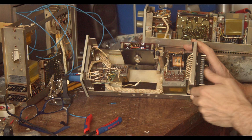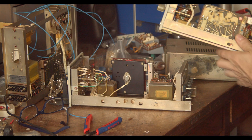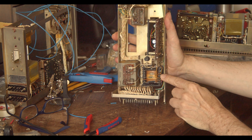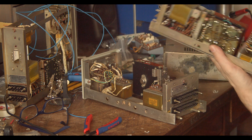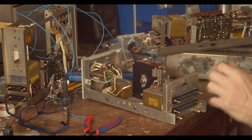We just have a different input transformer, and we do not have the pre-amp card that's found in the MV810. Then we have this inductor down here, which works as a broadcasting filter to filter off anything above 15k with a very mellow slope, I presume.